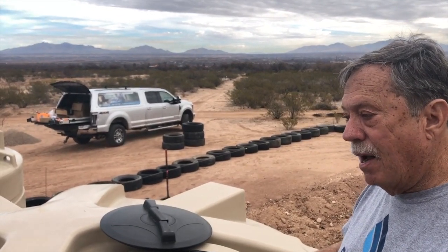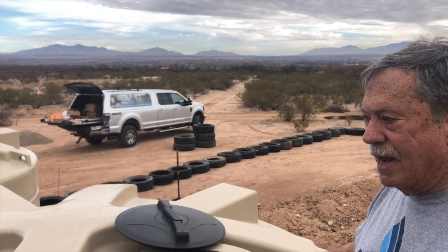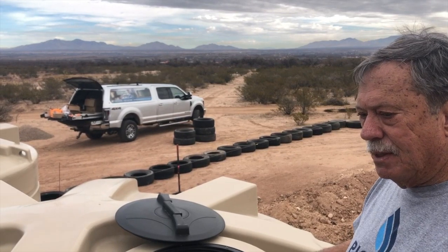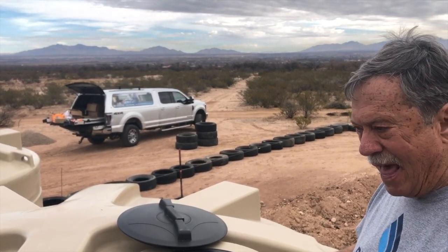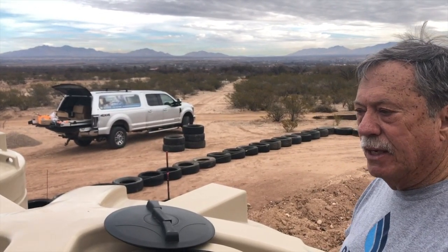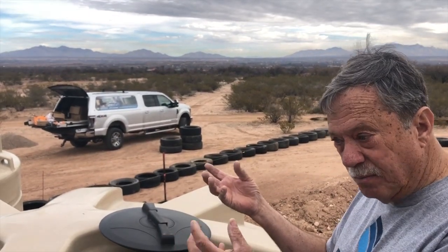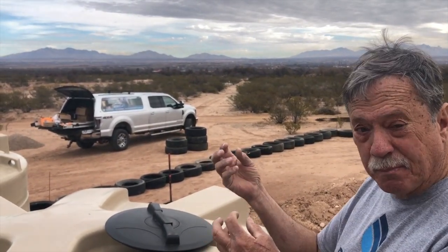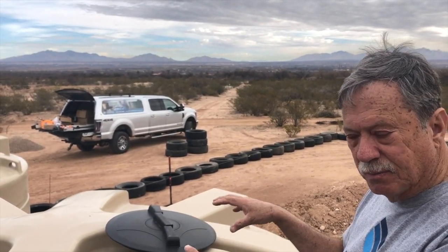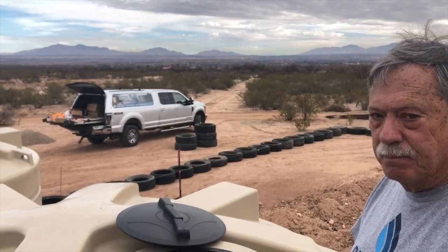And I will say this, going to the ARCSA conferences, I've been to a dozen of the national rainwater harvesting conferences that ARCSA puts on, and I've heard a couple presenters bring up the fact that mud in the bottom of your tank is not really a bad thing. It hosts microorganisms in that mud, and they swim up in the water column and eat things like viruses and bacteria. So actually having your own little microorganism system in the bottom of the tank with that mud is not a bad thing. I wouldn't worry about the mud in the bottom of your tank.